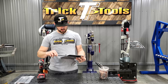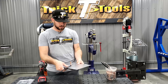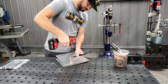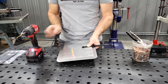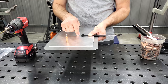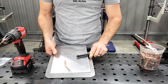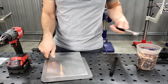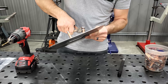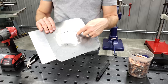You can then do it again on your next hole — line this up in your next hole, mark that, and when you drill, it's only going down through the drill bushing and then the layer of sheet metal between the two straps. Pop that one back out of place, and then you can grab whatever your hardware may be to pop it down through the hole. It's an easy way to locate holes that may already exist in a part and locate a new panel above it for different mounting purposes.